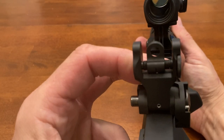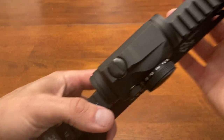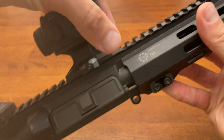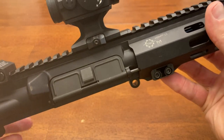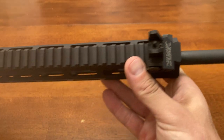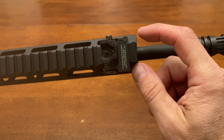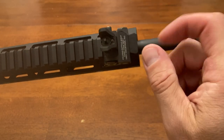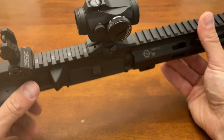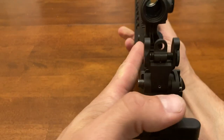Here are my complaints: I had to drift this to co-witness with a dot, even though the hand guard is clocked to the right a little bit — it kind of just fit between the tabs and the upper, so I left it. The hand guard is kind of uneven all over the place, but the inside edge to the barrel — I'm not measuring from the rail, but still — it's about even within like ten thousandths. I think maybe even less, so I had to drift it to the left visibly.